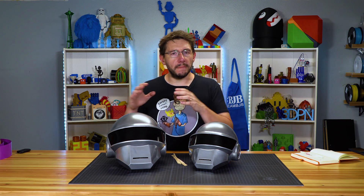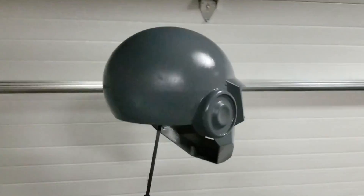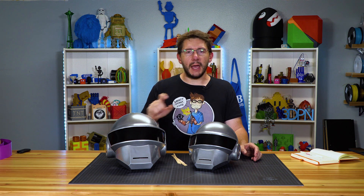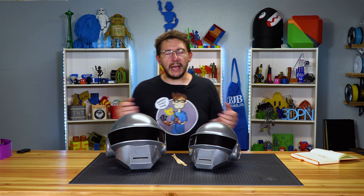After air drying putty was applied, cured, and sanded down with 220 grit, I used some filler primer. In the past I'd done a very heavy coat of filler primer, caked it on, let it dry, and sanded it down. For this one I wanted to do a light coat just to fill in some gaps — a lighter coat is much easier to sand. Filler primer can take up to three days to properly cure and dry, so a lighter coat also takes less time.